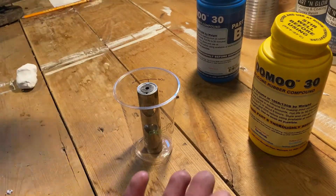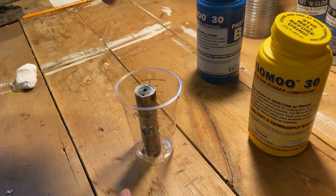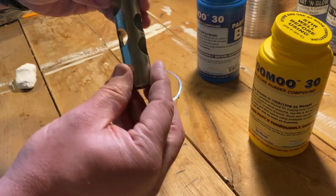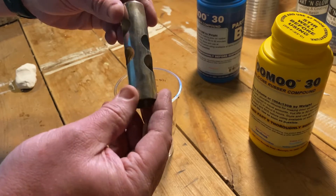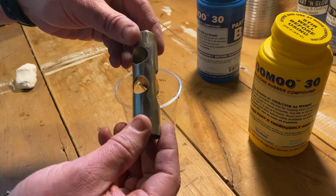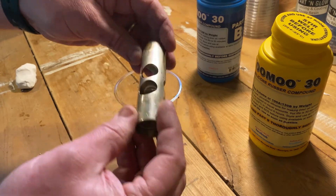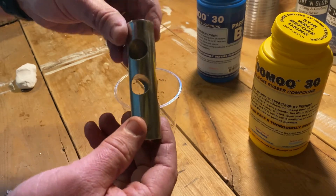I've got a couple of problems. One thing is if I allow the silicone rubber mold compound to go through the valve holes all the way through, it will be impossible to remove the valve from the rubber mold. So I have to compensate for that, but at the same time I do want it to go somewhat into the holes — because I want to know where the holes are, what the sizing is, and where the ports need to be. So I have to balance those two aspects.